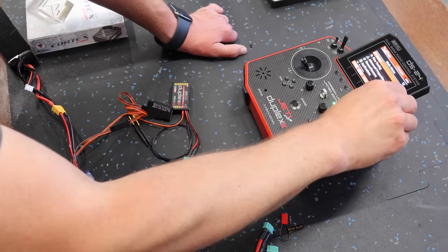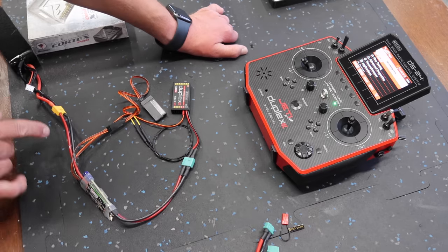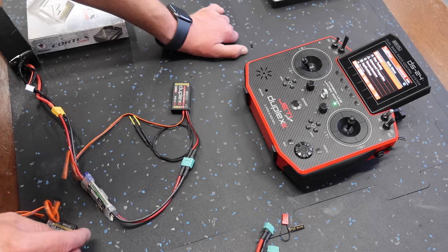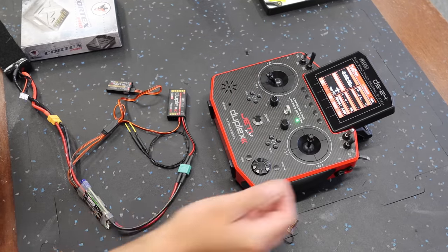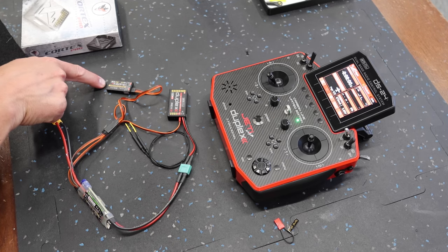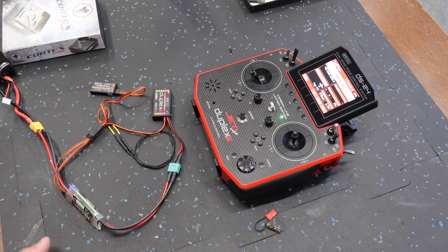That's done. We've got everything set up. Our primary battery is coming into the S-BEC right here. The S-BEC is feeding the REX-12. We've got our remote switch plugged into the S-BEC. Everything's off right now. We've got our lock switch which we'll turn to the on position — the red light on the switch turns on and the S-BEC turns on. So we've got our basic setup done, which is a step in the right direction.